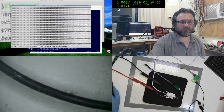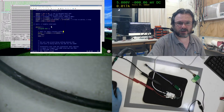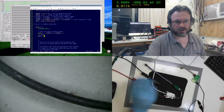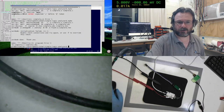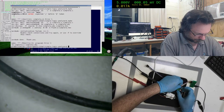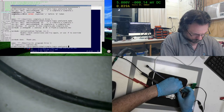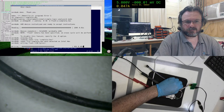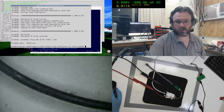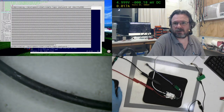I can't imagine why that would make a difference, but when it comes to these sort of microcontrollers, sometimes these sort of things can happen. For some reason, it won't allow you to transfer register to register directly. It has to be an intermediate variable. Like I said, these quirks can keep you going for weeks. Okay, nope. Still got the same problem.